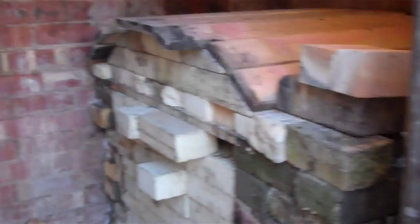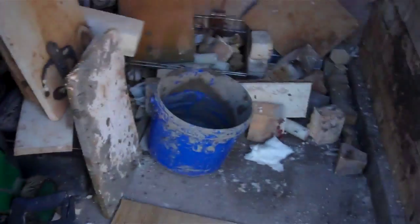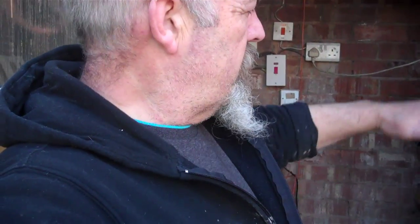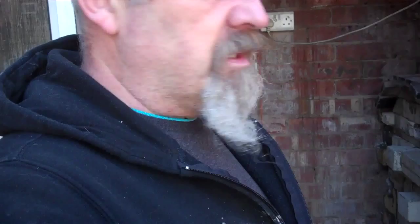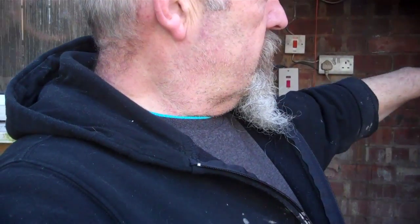And that's it. A bit of tidying up to do here from all the kiln brick sawing, and a bit of tidying up in there. I think we've broken the back of it. This front arch here needs to be cemented in with fireclay, and I'm going to put as much fibre blanket on top of the roof as I can. A full roll is about 7 metres, so I should get about 4 or 5 thicknesses — a good 12 inches of fibre blanket over the top to keep the heat in. I think we should get to temperature well enough. There we have it.